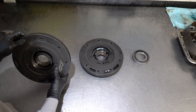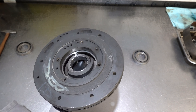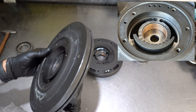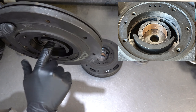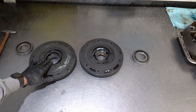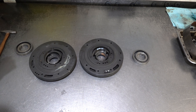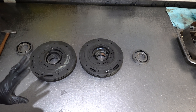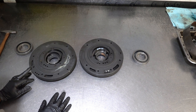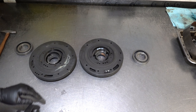On bushings — when you install a new bushing, because both these bodies need it and the bushings are excessively worn, make sure the oil groove exhausts toward the gears and the dead-end terminus faces out toward the seal. If you reverse that, fluid flow will overwhelm the seal, push past it, and cause a massive leak at the converter — you'll be constantly topping off fluid and will likely damage the whole unit. For those building F-100s, AODs, or any Ford transmission with this kind of one-way bushing, just be aware of it.